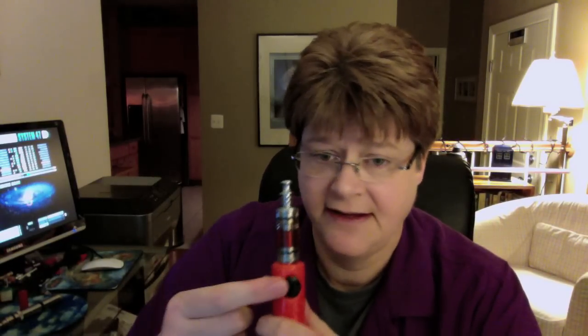So, the Kick. It's where vaping's going — power regulated, wattage regulated, intelligent thinking ones that constantly monitor your resistance of your atomizer and change the voltage you're getting from the battery to suit that. The other bonus is that it does have some short circuit protection. The only protection that's really in a Silver Bullet when you get it is that the spring will collapse if the battery gets hot, and if the battery does vent it will vent out behind the switch. Now it has short circuit protection because some of that protection is built into the Kick itself.